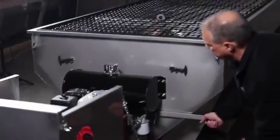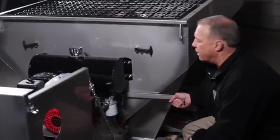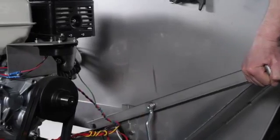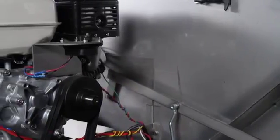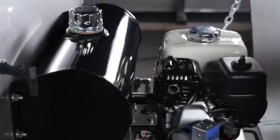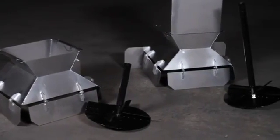As part of the hopper assembly, we include an adjustable gate to the rear of the hopper. This allows for just a release of the lever nut and an up and down motion to either close the gate for less material flow out the door to the spinner disc, or open the gate for more. Included on all of our Economizer models, except for the Hydra spread, are hoods that protect the engine, gas tank, or hydraulic tanks on any of the units so that sand and foreign material don't get inside or poured on top of the engines.